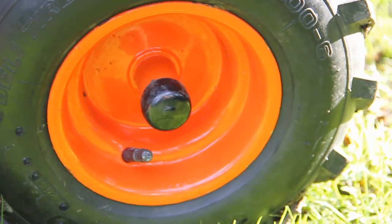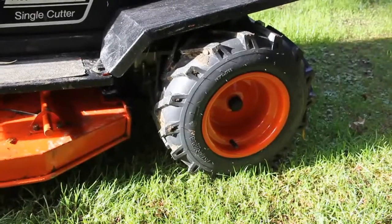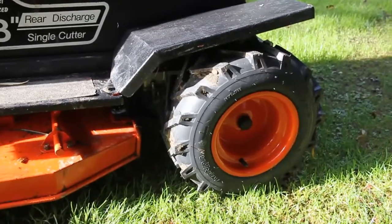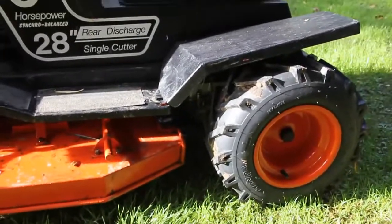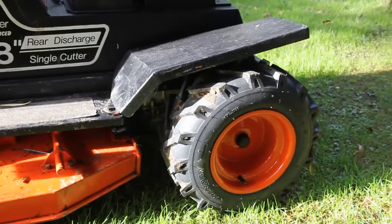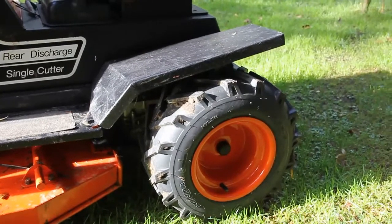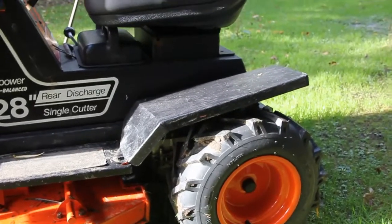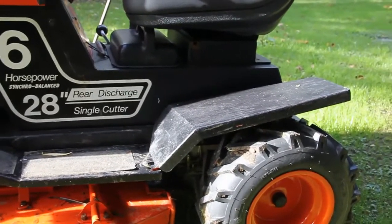The benefit of having inner tubes on these tyres is that when you need traction, you can let the tyres down so they can grip more. Because this tractor is mainly just for snow ploughing in the winter — except for a bit of grass cutting in summer — it won't be used that much the rest of the year. I need lower tyre pressures, and because it's got inner tubes in, I can let them right down without it de-beading, giving me maximum traction. On the back of these little machines there isn't an awful lot of weight anyway, so I have to let the tyres right down to get the traction I need.